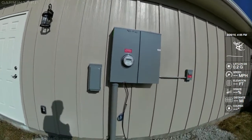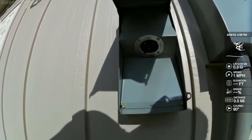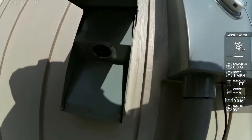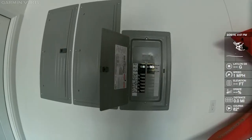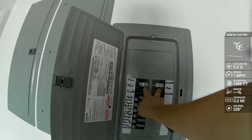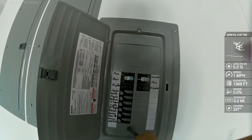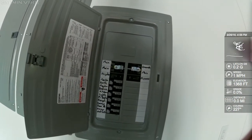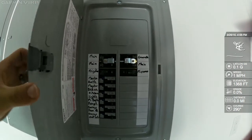Another cool feature is the meter base — they've pre-wired it with a generator inlet plug. It's a 50-amp, 240-volt inlet, and it's a male plug so you have to come at it with a female plug using a proper generator cord, not a suicide cord. The generator plug feeds into one breaker and the grid feeds into another — this is called an interlock kit. When one breaker is up, the other must be off. This lets them use a small sub-panel with all their critical loads and instantly switch over to run the house off a portable generator. It's another way to hook up a portable generator without a full automatic transfer switch.